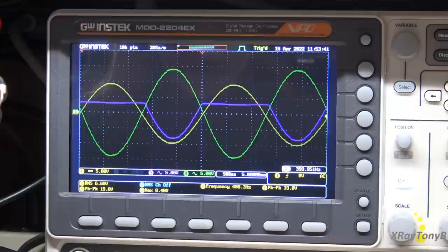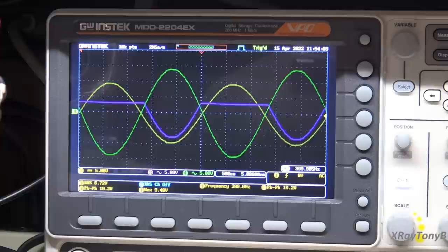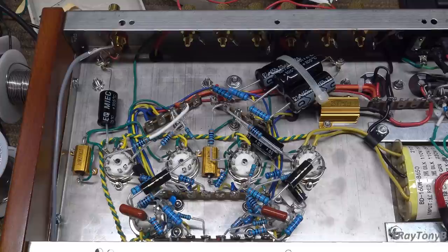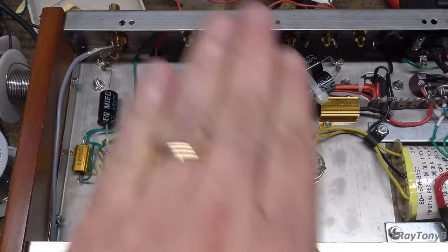When we push too hard, the two out-of-phase signals oscillate. The reason they're both oscillating together is because that oscillation is taking place not in that tube but in the prior stage — the voltage amplifier stage. You can see those two capacitors there — more than likely there's a problem with that and that's what's causing the oscillation. But other than that, when we drive it at a reasonable signal we get a really nice clean output. That yellow trace is what would go to your speaker, and the green and purple traces are your two out-of-phase signals. I'm not going to touch anything because I think when we get the other channel built, this is all going to straighten out.